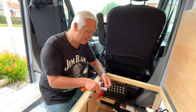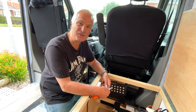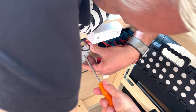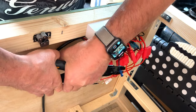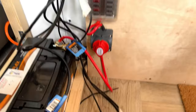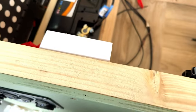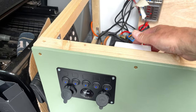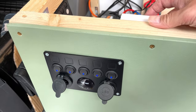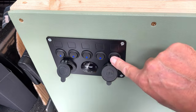I'm just going to fasten the negative bus bar to the cabinet wall and fasten the two ends of the negatives together. As soon as I switch the isolator switch on at the fuse box, we should have power to the front. I'm just going to turn on the fuse box at the isolator switch. That is bringing power straight through to this switch. I've just got the switch here - the socket is on, so let's turn this switch off - and it's isolating that switch box now. Perfect.